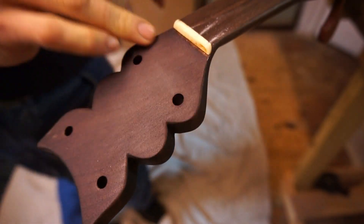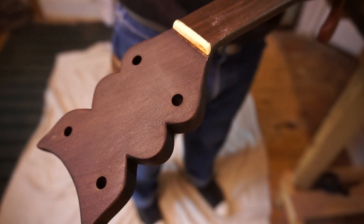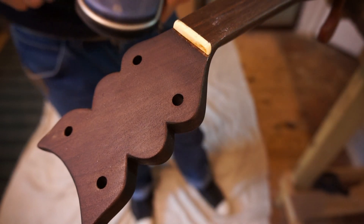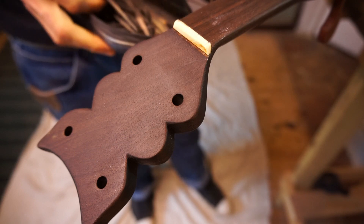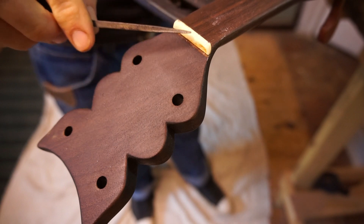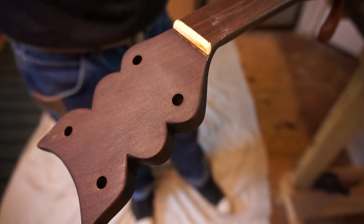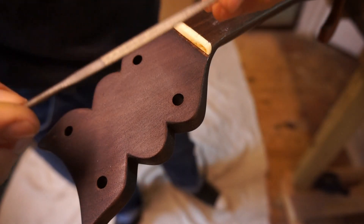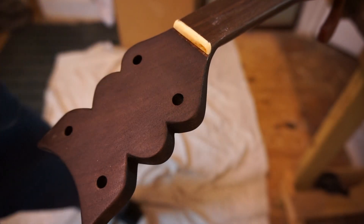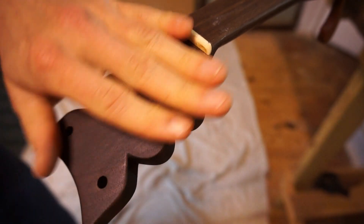I like the angle and I like the depth on each of those. One more trick you need to do: take a little needle file — something with a triangular cross-section — and you need to open up the back of each slot. Get some kind of little tiny file with a slim profile and carefully open up the back of each of these without scratching the surface of your nicely finished peg head.